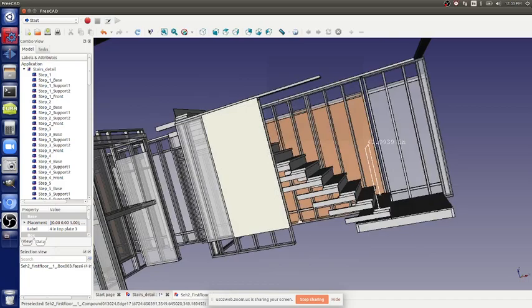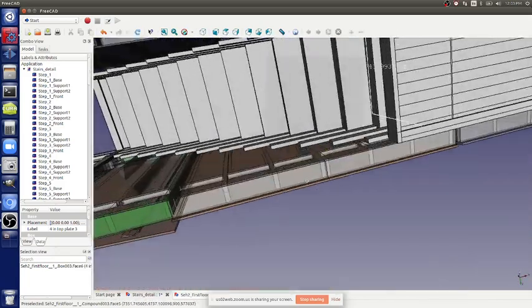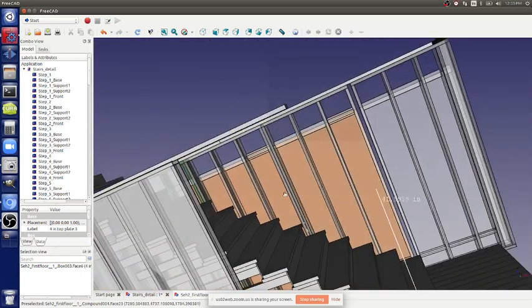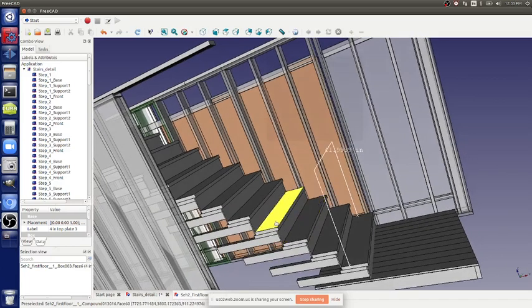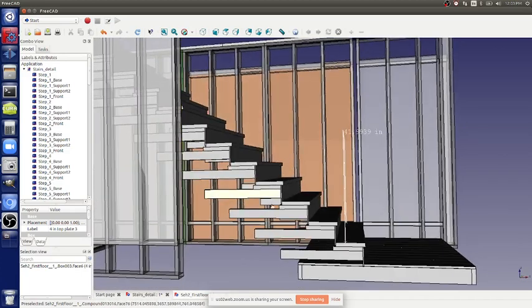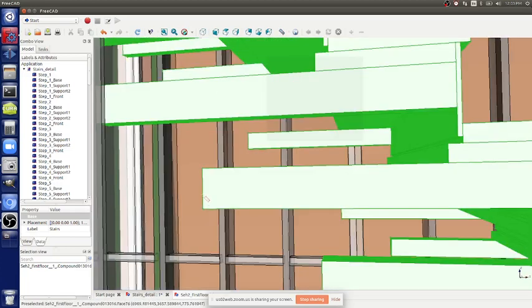Now, we've got the double rungs, because we have nothing supporting in between. There's no support in between, so it's almost a 4 foot span. For that, the code says you gotta use like a 4x equivalent. The 2x equivalent will work, but after a few years, it'll start crumbling on you. So double is more of a lifetime design. The good thing is, after we cut these pieces, how long are these?